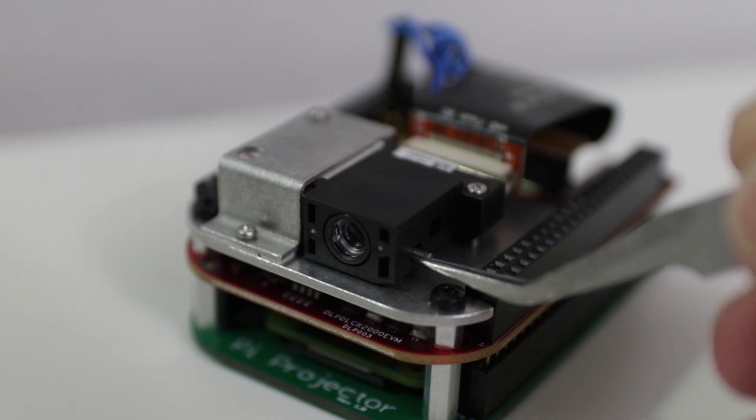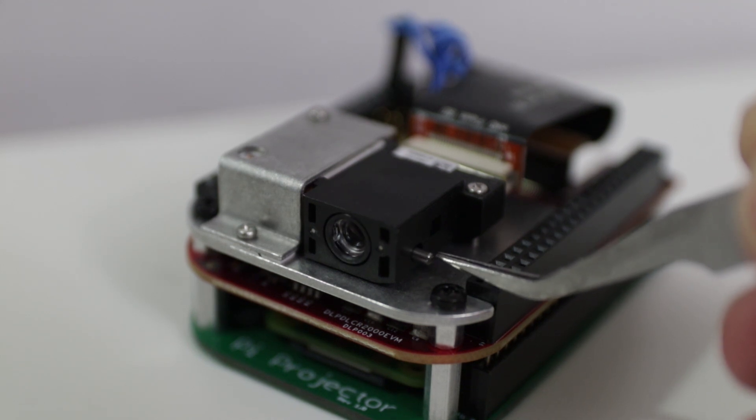This is a very cheap solution to running a Raspberry Pi and it runs pretty good. I really like this project and where it's heading. It's missing some USB ports, but eventually that will be resolved. The power pin has to be connected via a little wire in my version, but I know version 2.0 or 2.1 has resolved that. The focus point has this little needle you have to move around to get focus — it's very, very sensitive, so you could just flick it and it'll be out of focus. I'm thinking about sticking a little grease at that joint to give it some friction. And I might create a case for the whole thing once I figure out how I want to put a LiPo battery in there.